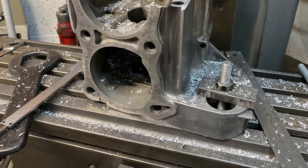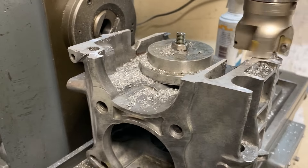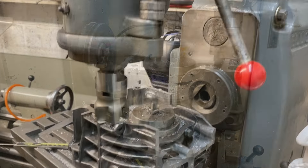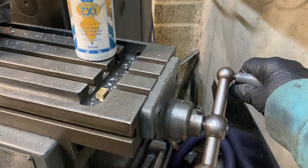Here's the left-hand casing on the miller machine to mill up the surface I've just sawed with a hacksaw. It's quite true really — I only had to take a little skim, but it's nice to do it on the machine; it makes it so much easier. When I'm using my old mill I take things quite steady, cutting at a slow speed and turning the handle slowly.